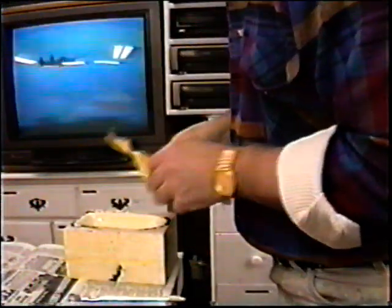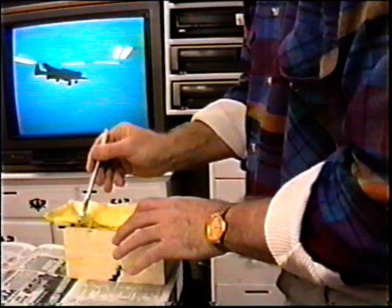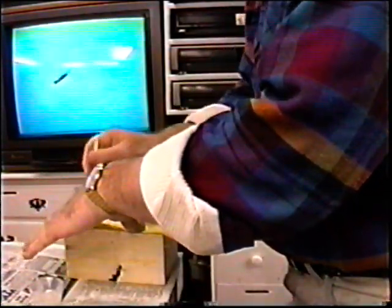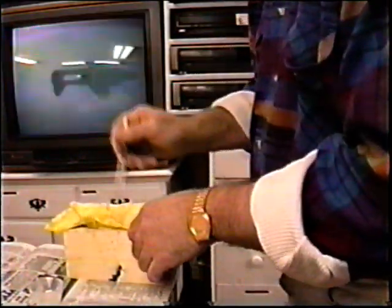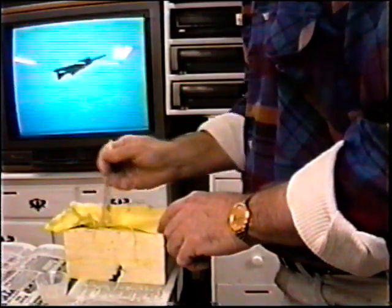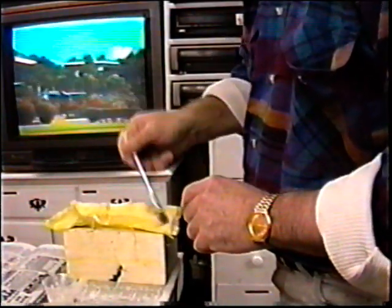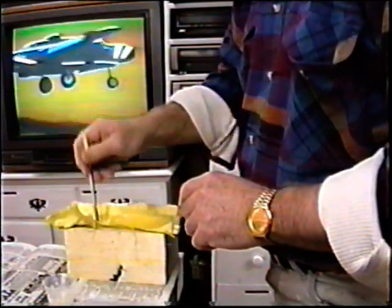Anyway, we'll give this a shot. It'll be an interesting experiment. And that's another point you can always take into account: sometimes it's worth doing things just for an experiment. See, trying to wet this out is difficult. It's a lot more difficult than e-glass. So if you were just starting in at doing some kind of molding, you wouldn't want to start using Kevlar. Start and do all your practicing with good old-fashioned e-glass, the white stuff. Kevlar is yellow in color.